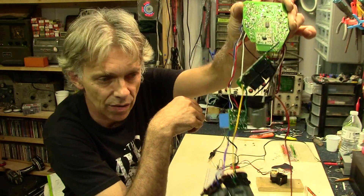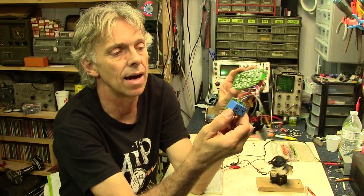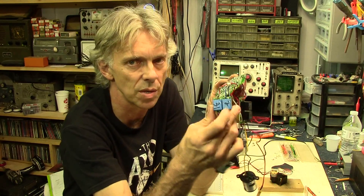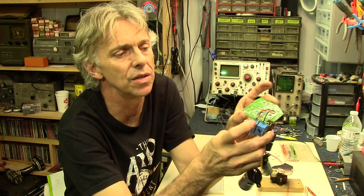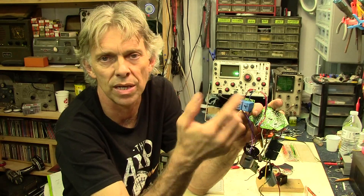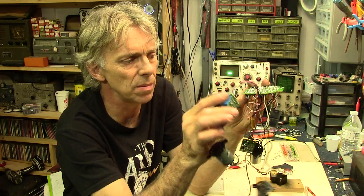In last week's video we pulled apart the RC toy and got all these goodies out. You saw me trigger the motors on some of the pins that come out of the Black Blob microcontroller. These are relays and these motors are run via these relays — what I was doing really was triggering the relays. Someone mentioned in the comments that you probably can't do pulse width modulation through relays, because you're turning them on and off really fast and that may not work. What you could do is turn the relay on and then modulate the voltage that feeds the motor with PWM once the relays are on. All these relays do is serve as an H-bridge — a double relay H-bridge. Just Google two relay H-bridge and you'll see how that works.